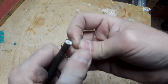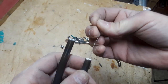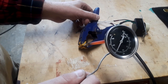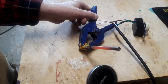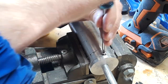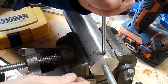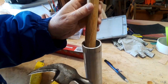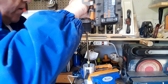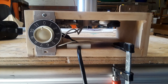I admit for the princely sum of $12 that I paid for this thing, something inside of me wanted it to be a little more complicated. The heating element I'm using this time is a cartridge heater — a tip from Chris at Highline Guitars who a few years back made one this way. My game plan is to reuse the old pipe, attach a top cap to it, stuff it full of aluminum foil, keep it all in with a bottom cap, drill a 5/16 inch hole to accept the cartridge heater, and mount it in a box.